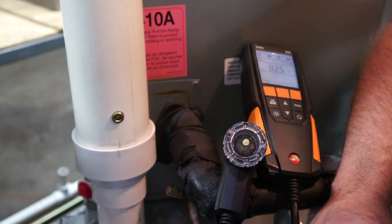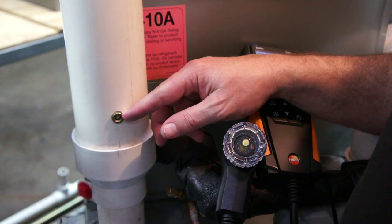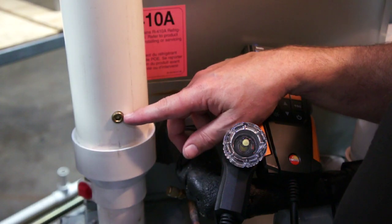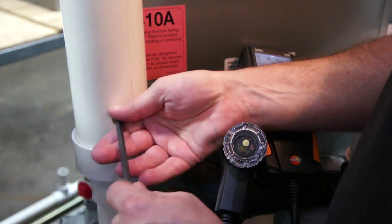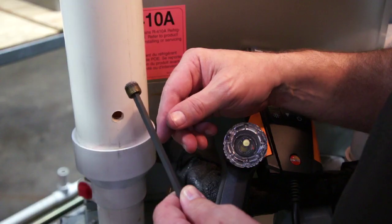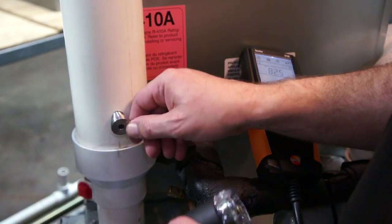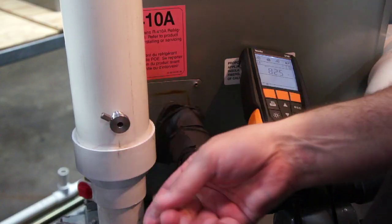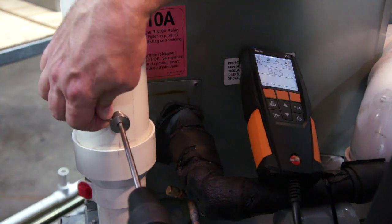While showing the 310 in use, I wanted to mention how to make a penetration in a PVC pipe when you can't access it outside, for example where it goes up through a roof. My preferred method is a brass tapered pipe plug — it seals the hole nicely because the taper wedges into the pipe as you tighten it. It's easy to get in and out and pretty tamper resistant. You thread the cone right into the PVC pipe; it bites on the first few threads, locks in, and holds. Then slide the probe all the way to the back and pull it halfway out to make a combustion measurement.